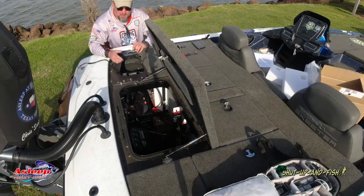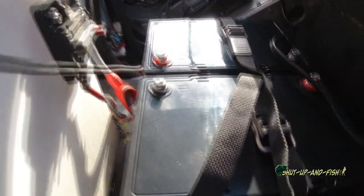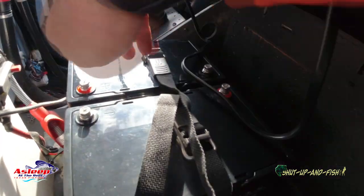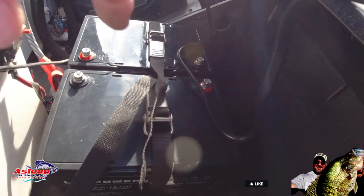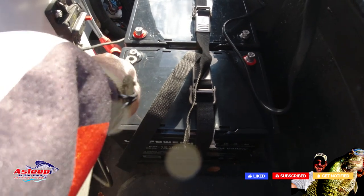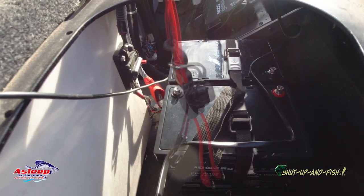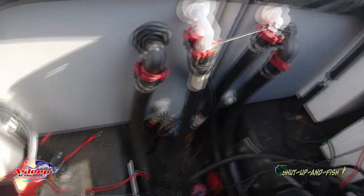All right guys, I'm using two cameras here. Basically, this is the setup with the brand new batteries. The way I have them set in here, my positive is coming in right here from my trolling motor cable — that will go here. Then I will series using this cable, connecting this negative to this positive. Then my negative goes here into that, which will give me 24 volts. I do have to add the charging cables for each battery, and that will all go in there together.